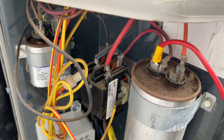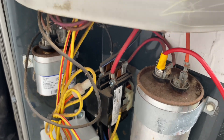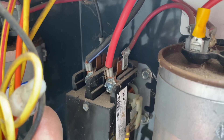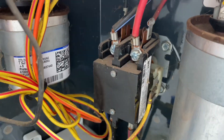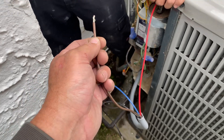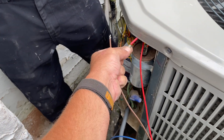For step two, we're going to disconnect the factory installed compressor run wire from the contactor terminal called T2. There's my T2 wire, which is also going to common on my compressor capacitor. We're going to remove this wire. The next step is we're going to take the brown wire going to our soft start and connect it to the previously disconnected compressor run wire, which is going onto T2.